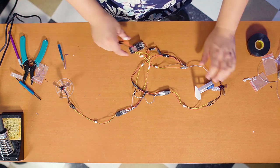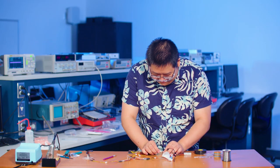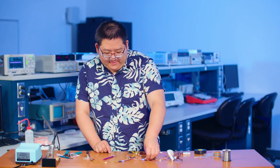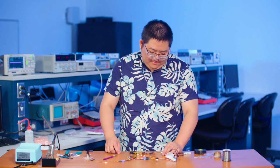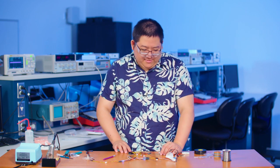The last thing to do would be to connect the battery. When you plug in the battery, both ESCs should light blue and you should hear a tone of six beeps. But because this feather is not programmed, we only heard three beeps.